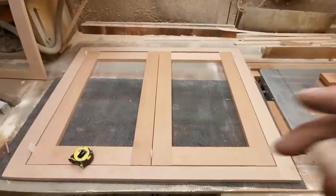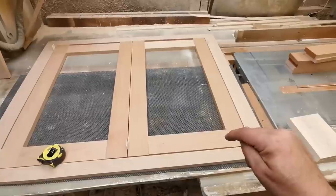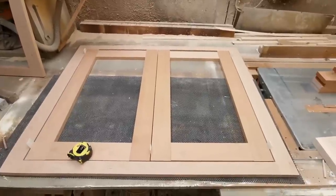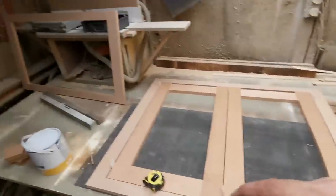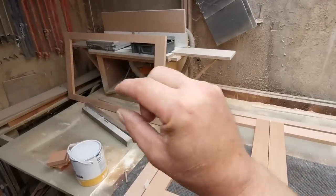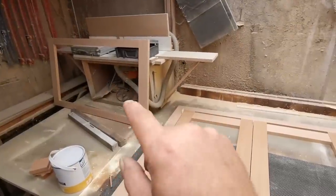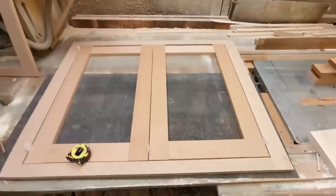When I first drew this, I was going to make this bottom rail, they're 80 mil at the moment, because then I can get two dominoes in nicely. But I was going to make it slightly wider. Bottom rails on doors are quite often a bit deeper. But when I did it on that board to match, it just looked wrong. So I've gone 80 mil all around.